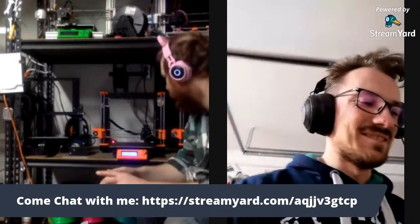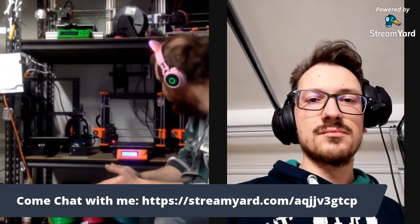Little OLED. So I have three Kiev 60s, and all of them I've been able to calibrate the shutter speed pretty well with a little laser tester. But I had three Kiev 60s, and between them they had 5 problems. There was none that were perfect. The overlapping I was able to fix on 2 of them, and then one of them there must be a gear missing a tooth because there was no side of the eccentric that I could make work consistently.